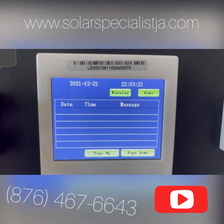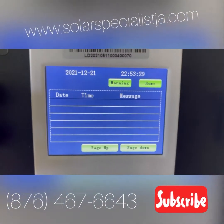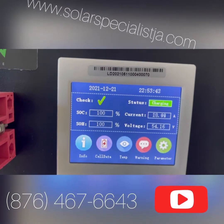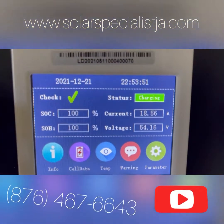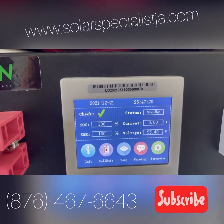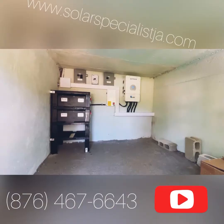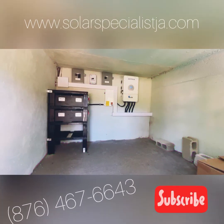It's important you check your battery history when you first get it, to make sure you got a brand new battery with no history of any activities — because this is a brand new battery and brand new installation, so the history will be clear naturally. Once your battery is getting to the point where it's fully charged, it's going to regulate itself until it goes on full standby, which means it's totally charged and floating. It's like every time we do a system, it keeps getting neater and neater.